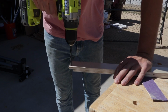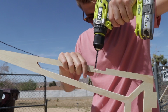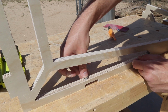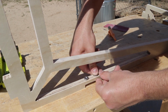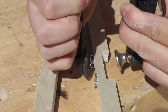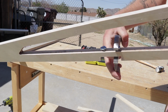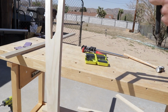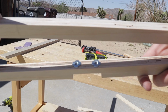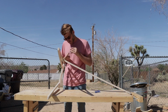If I was making a permanent desk, of course I would use glue and screws so that everything was as strong as possible, but because I want it to be portable, I need to use mechanical fasteners. For the legs, I used T-nuts. They're just threaded inserts with teeth on them that allow them to dig into the wood and stay put. I'll leave a link to those in the description along with everything else I'm using. After failing with an F-style clamp for a while, I realized that vice grips work really well for getting these dug into the wood. The ones I use have 1/4-20 threads, so I just used a bolt to attach the stretchers to the legs, 2 on each side.